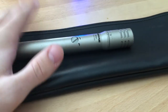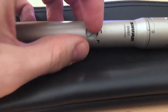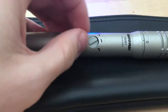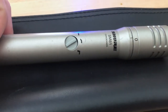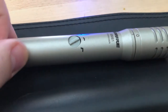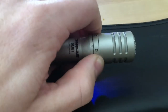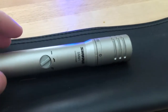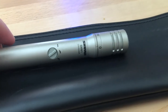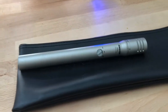There's a low frequency rolloff switch on the front. Right now it's set to flat frequency response. It's actually pretty difficult to switch with one hand because it's so small. You have flat frequency response, then a low rolloff, and then a more extreme low rolloff. There's also a pad — negative 10 dB — and you can roll back to zero. It's like a little collar around the neck of the microphone and you can easily twist it to turn the pad on or off.